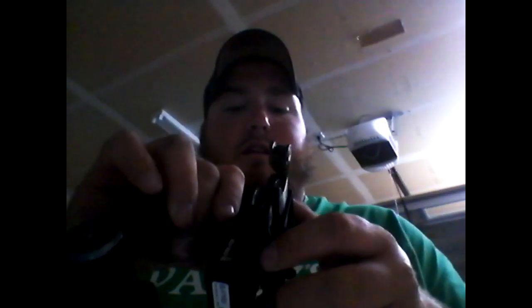The gimbal. Let's see, the side with your holes is front. You slide that sucker in there, just like that. So, on your 350QX, you're going to go ahead and take your vibration dampener plate off. And you're going to mount this in its place. Okay, so through the magic of pause, I put it on.